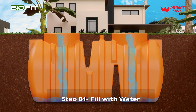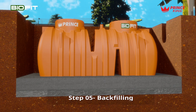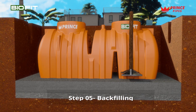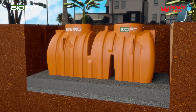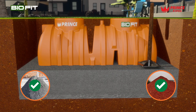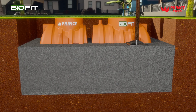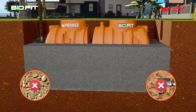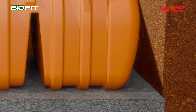Fill the tank one-quarter to one-half full to support soil compaction and maintain structural integrity. Commence backfilling in layers, each with a maximum thickness of 250 to 300 millimeters. Use sand or soft murrum for backfilling — do not use excavated materials containing rock, peat, or clay.